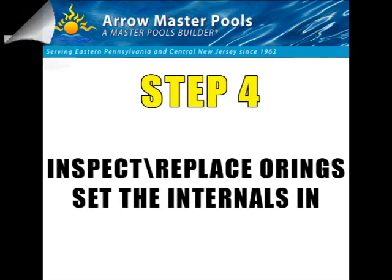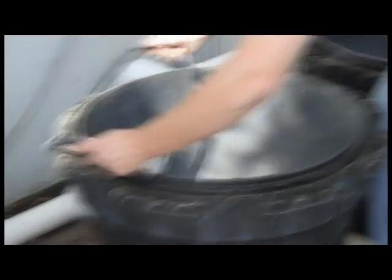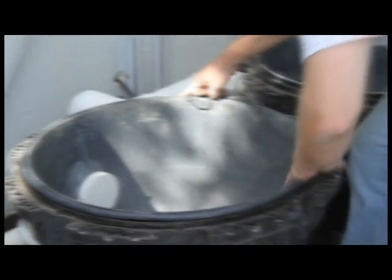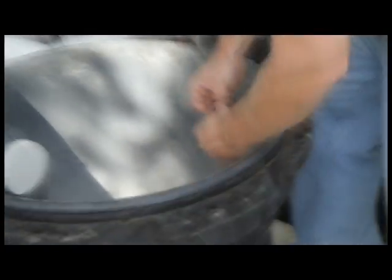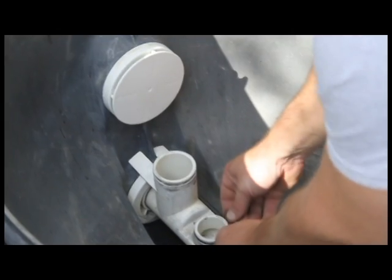Now for our last step, we're actually going to replace our O-rings if needed and put back in our cartridges. First, make sure the O-ring track was clean and free of debris — take a paper towel and make sure this O-ring track doesn't have any debris in it, because otherwise it can make the O-ring leak. When putting on a new O-ring, set it down in the track on one side and actually pull and stretch it — don't roll it. If you try to roll it to put it on, it's going to pop off on you. Down here we have our manifold O-rings — you're going to set the O-rings into the tracks around the nipples.